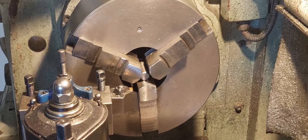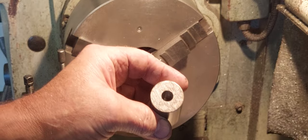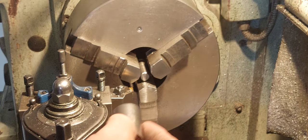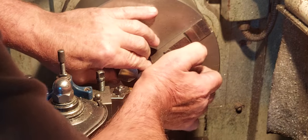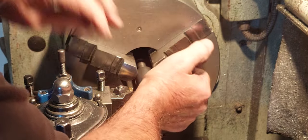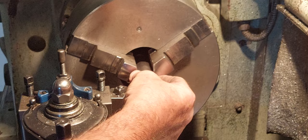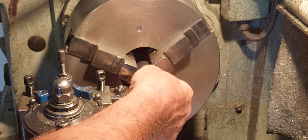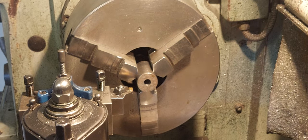CNMG insert for those curious. We've got our bush — the rough end we're still going to machine off on the other end, and the nice end we've already machined. I wound the jaws out, and yes I did leave the chuck key in there still. You just feed it through until you've got what you want hanging out the front, then go around and set your screw.